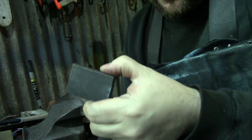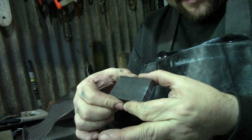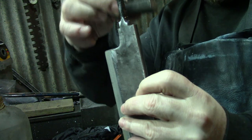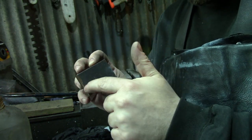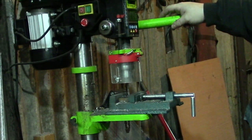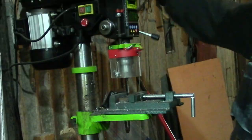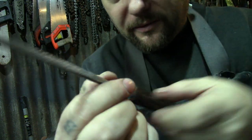I'm now going to mark out where I want to drill it, because I'm going to drill the hole then shape this — it might be easier, because I can clamp that in easier in the little vise to drill the holes. So I shall drill a hole through there, as close to that as I possibly can, then I'll probably start filing it square so that it can fit over. Once I've got a nice fit I can work out what sort of shape I want — I think it will be some sort of oval kind of shape, or pointed at each end. Right, so that's the hole drilled, now I just need to square off the edges with a little square file.